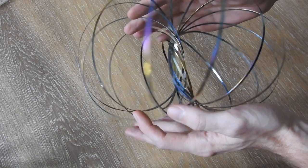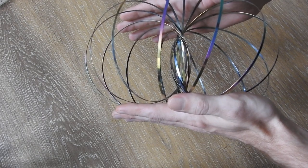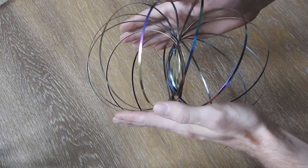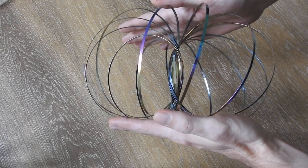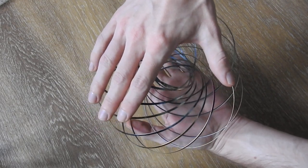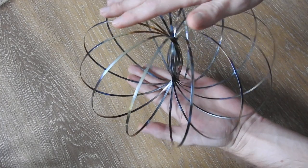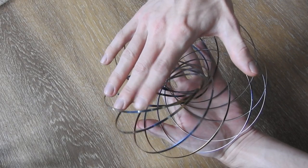The magnetic field itself also gets smaller. This is also the difference between a strong magnet and a weak magnet. If you take two identical shaped magnets — one is N40 and the other N52 — you will see under the magnetic viewing film that the weaker magnet has a bigger magnetic field and a smaller hole in the center. The stronger magnet has a bigger hole in the center but a smaller toroid or magnetic field. This is only because you change the rate of gyromagnetic precession.